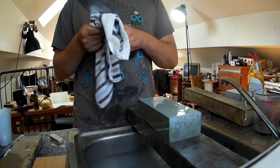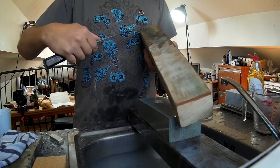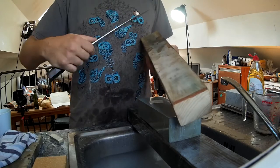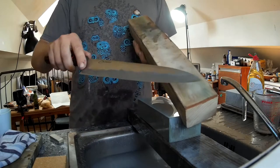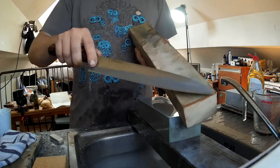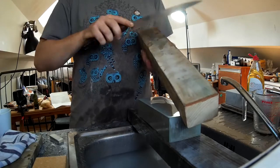Have your strop handy, get the blade dry, and then just strop using backstrokes at the angle you set — the angle isn't critically important. There will be a tiny micro bevel of around that angle at the end, but the larger part of the bevel will be completely removed by the next process. Give it a good strop.